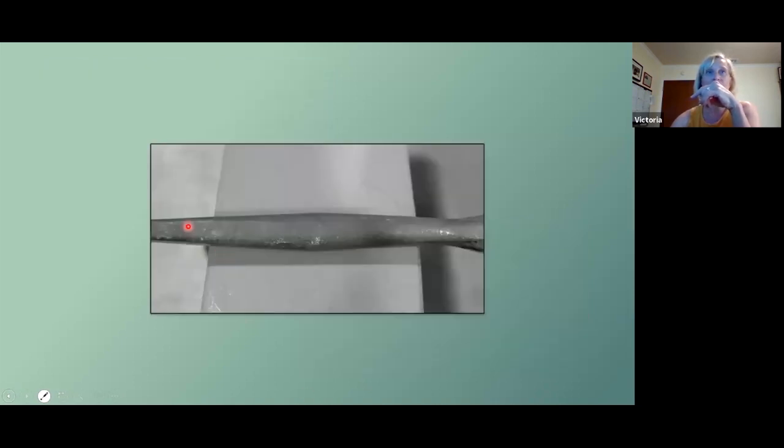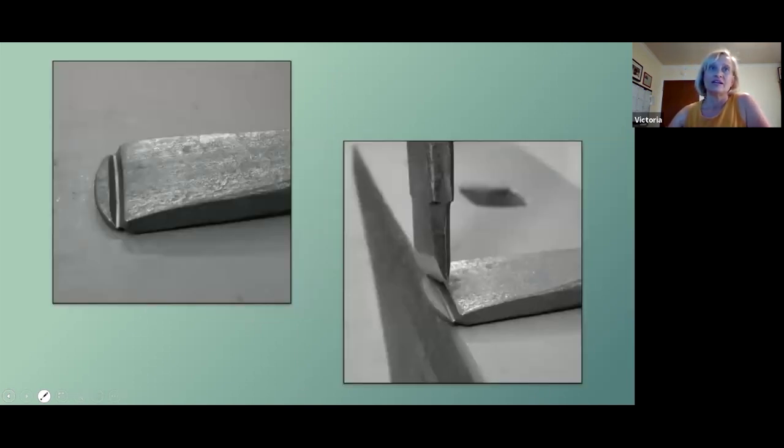And all the taper should meet up somewhere in the middle. So tapering from the indexing, tapering from the chisel. And this chisel point is parallel to, or on the same plane as, the indexing. Next, you want to file this flat, and you can give yourself a head start by just cutting that off.